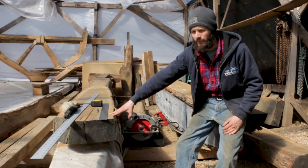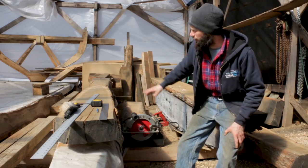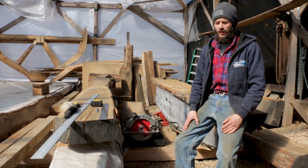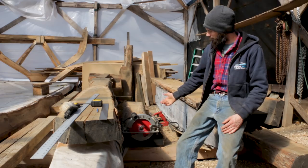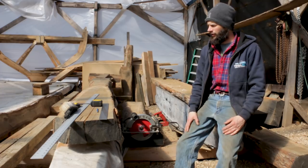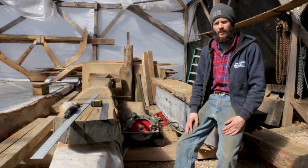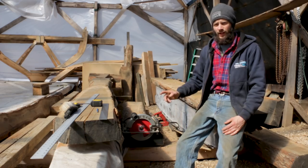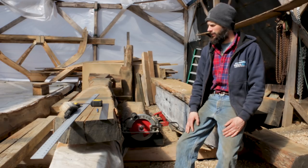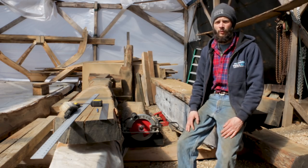These timbers — we originally thought we were going to use them for the bow and stern posts, but they checked pretty badly. So this way we can cut around those checks and still use them. Before I can throw it on the bandsaw, I need to get it down to a more manageable size with the skill saw — the big Sasquatch. Then once they're down to a liftable size, I'll put them on the bandsaw. The goal today is just to get a bunch of square pieces set aside. Then once we get back from the boat show, hopefully the weather will be warm enough to get the keels together, and we can start planing, thicknessing, and gluing the deadwood.